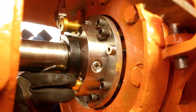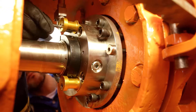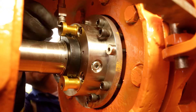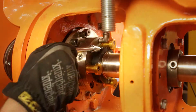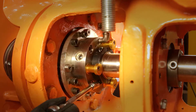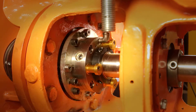The setting tabs are little bobbins. Loosen the bobbin and roll it into location. Once the setting tabs are locked into place, unlock the mechanical seal sleeve from the shaft. In this case, this is done with a clamp collar. Loosen the clamp collar. On some seals, this is done with set screws and you'll have to move around the shaft to loosen all the set screws, but only after your setting tabs are in place.